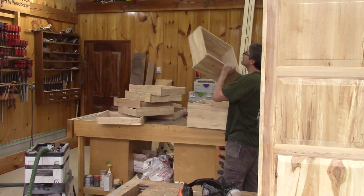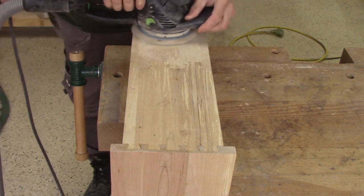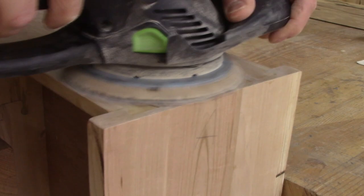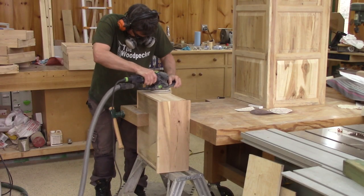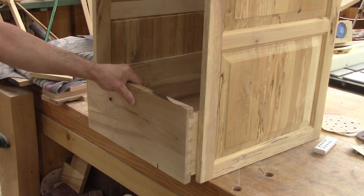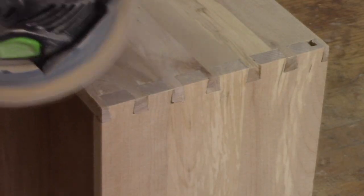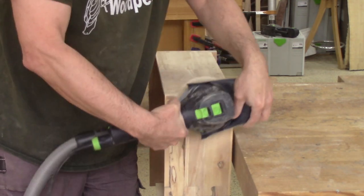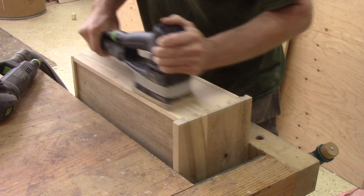When it's dry, I can sand the exterior of the drawers. I begin with the biggest one. When the first sanding is done, it's time to check if it fits. It fits, but it's getting stuck at the end. It was to be expected, because the panels and the stiles are not at the same height and the sharp corners of the back are catching. To fix this, I round off the back corners and give the drawer its final sanding.